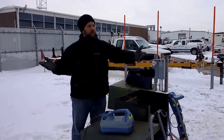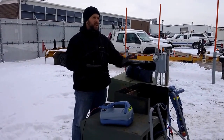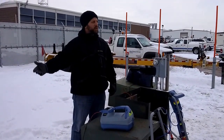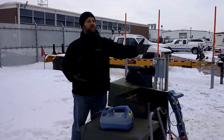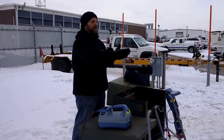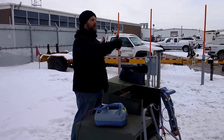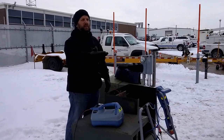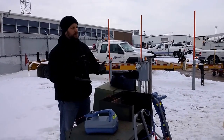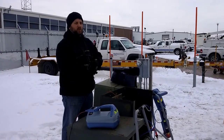They're both about the same as it's completing the circuit. After you get all hooked up, you can take a reference reading with the A-frame right next to the ground rod. If it reads say 92 decibels, it probably should read around 92 decibels out at the fault if it's the only fault out there. If there's multiple faults, they'll probably add up to read 92. So if you get to the first fault and it's only reading 20-some decibels, keep going to find another reading closer to 70 or 80. This is a nice tool to verify multiple faults, because if there are multiple faults you may just want to replace the old cable.